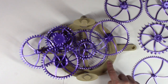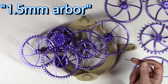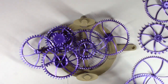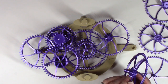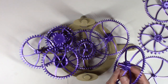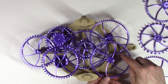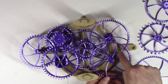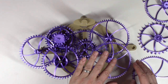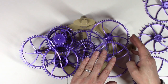Another arbor goes in — your design will have a taller hub in this hole that keeps all of the three millimeter arbors the same length and makes it a little bit easier, so there's no need to distinguish any of the one and a half millimeter arbors. Then insert gear two, which is the one with a tall shaft. That tall shaft allows its pinion to interact with gear three, which has now been slightly raised up. When you rotate it, you should see gear three rotating as well.